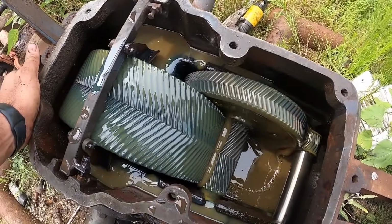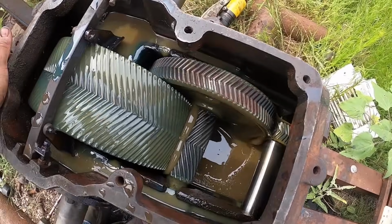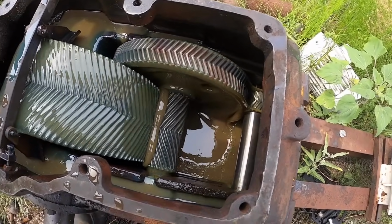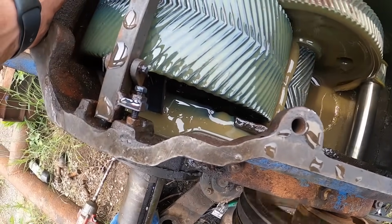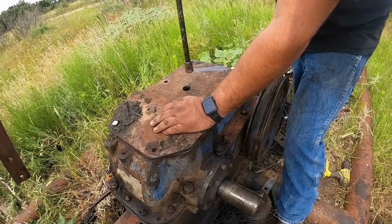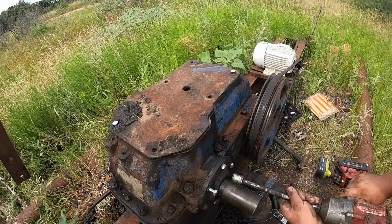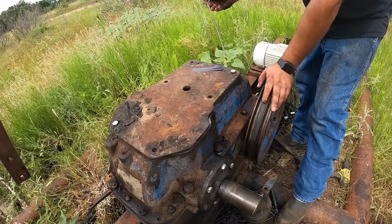Now you can see with that heavier oil how much more oil this scrapes up and dumps in the oil trays. If it ran faster, 90 weight would have been fine, and 90 weight would probably have been fine anyway. There's not a lot of oil movement in there with it, and we're not going to hurt anything. You see that it's literally a river down on that bearing. Same way with that.